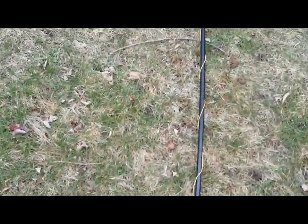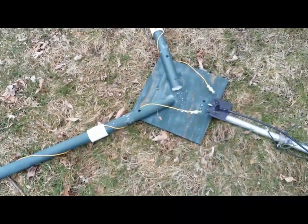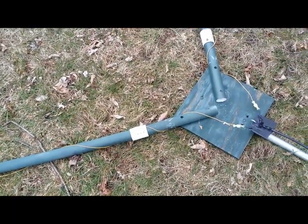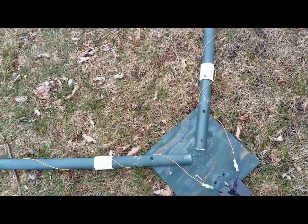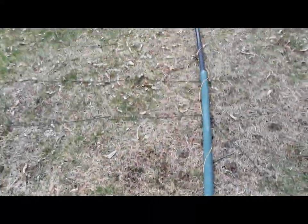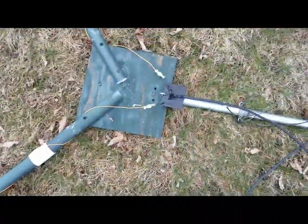On the 20-foot wonder poles you're going to need to do that because the poles aren't quite long enough — that's why I have the five-foot extensions on them. It doesn't make a bit of difference how the thing works, it'll work just fine. The easiest way to do it is to grab the wire, lay it out on the ground in a straight line, hold on to the wire and the pole, and just turn it — put on about 20 helical turns. Wind the wire right down the pole, drop it in the tubes, jack it in, and you're done.